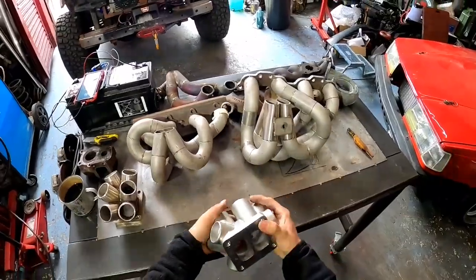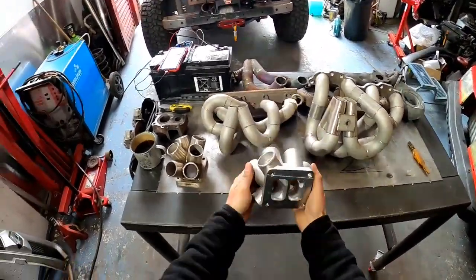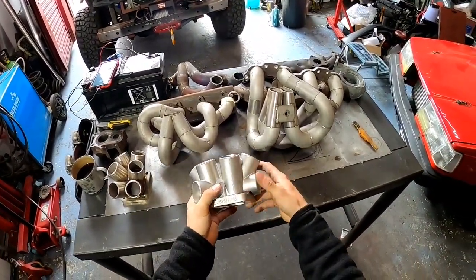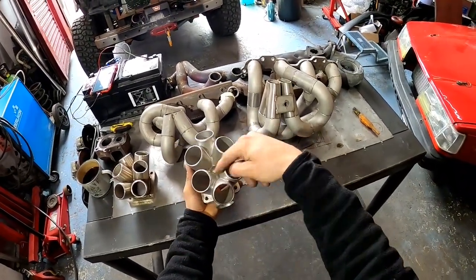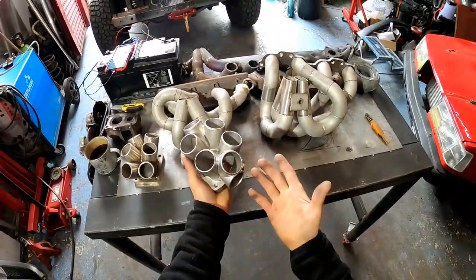However, what they've done, you see the scroll is divided, like I said, this way, not this way, okay? So this will not apply to the twin scroll, like I said. What these guys did is something very clever. These 3 pipes, they're not spread at 1, 2, and 3. They have these 2, and the third one comes from this side. So this is a great space saver.